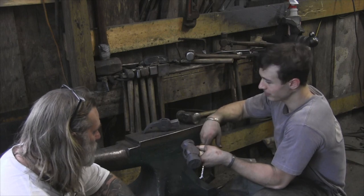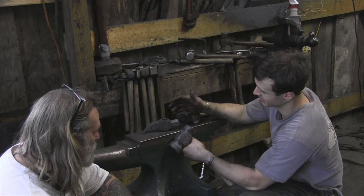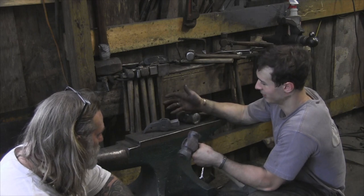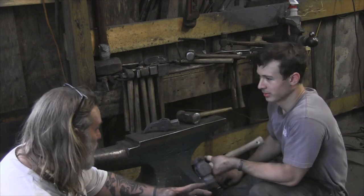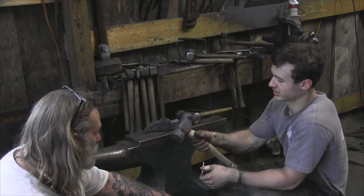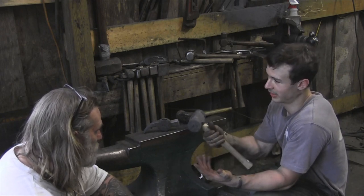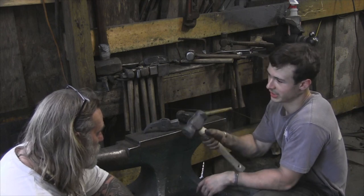Okay, so they're both great hammer steels. They're just heat treated different ways, and some people prefer one over the other for different things. For a simple process, for somebody making a hammer, this is water quenchable. Anyone can heat treat this. Heat it up to yellow, do an agitated quench in water, and then temper at 400 for two 2-hour cycles.